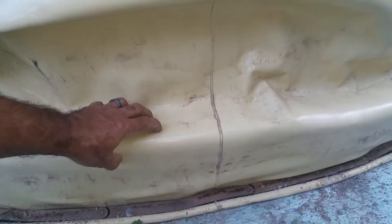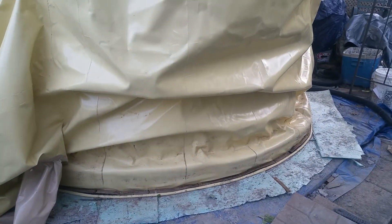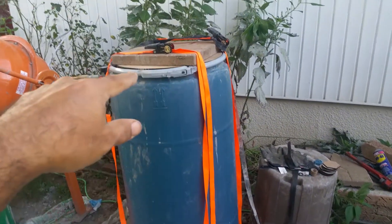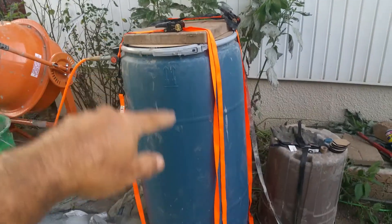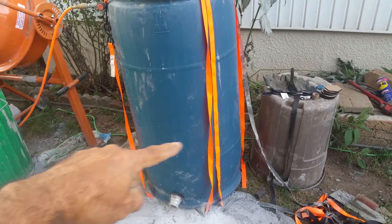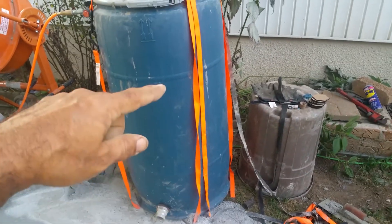This was my main idea — my main concept was using aircrete and pouring it into an air form, a second form that will retain the aircrete inside while it cures. That being my main idea, it is a success — it worked. I stopped here for two reasons: number one was my pump failed because the lid was not strong enough to hold the air pressure. Up to this point it worked well, pushing the aircrete down the hose into the dome.